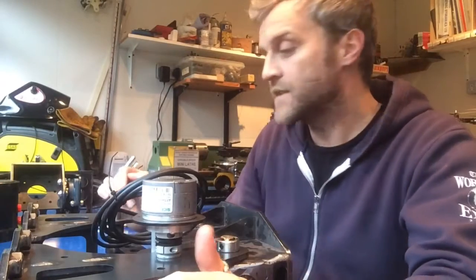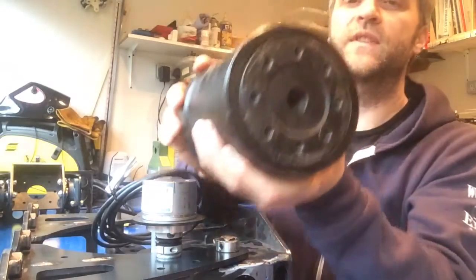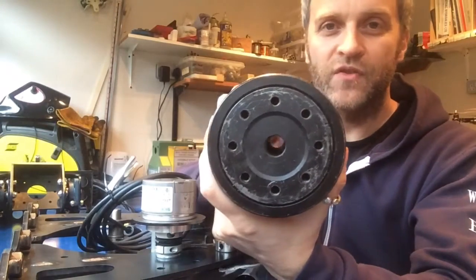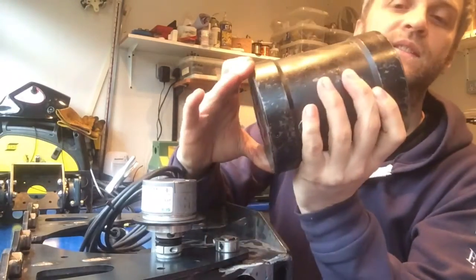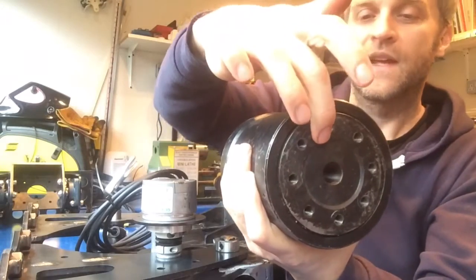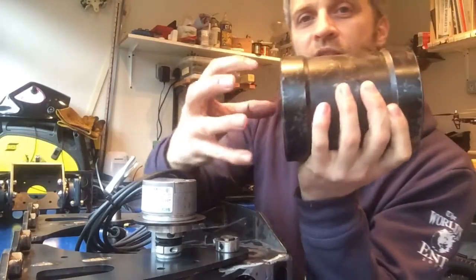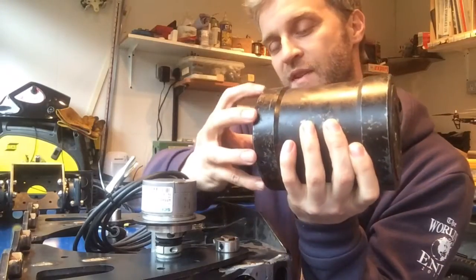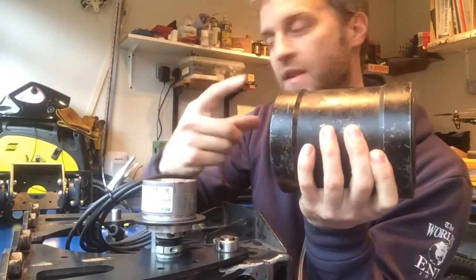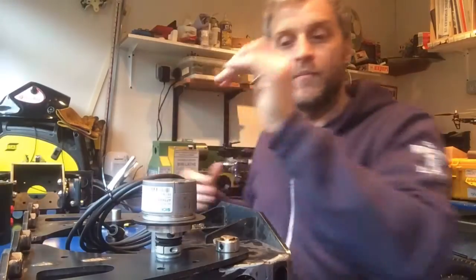That's really good. I still need to do the other couple of axes - three axes total. The trickiest one is the rotary axis. There's a big hydraulic rotary axis, and what will happen is a shaft passes back through the encoder to the back of the mechanism. The encoder sits at the back here - this bit stays still and the shaft of the encoder rotates. That's going to be an interesting one to rig up, but that's what I'm onto next.